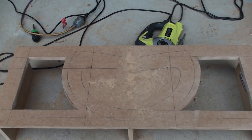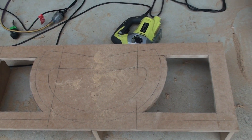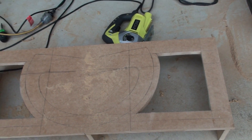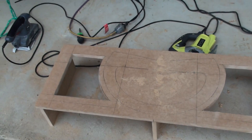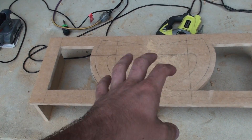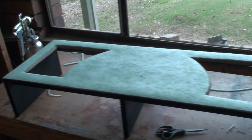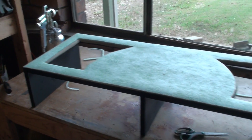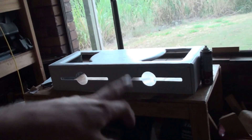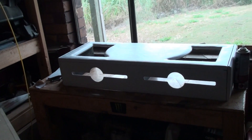Now doing a 45 degree chamfer around the top and a rabbeting underneath so I've got a spot to wrap it and put the grills. You can see where the TV sits - it shouldn't have taken much strength out of it really because the TV is sitting mainly in the middle portion, so all the weight is load bearing in the middle. I've cut out the foam - used scissors for most of it. The top was the hard bit to wrap because of the foam, but it came out alright.